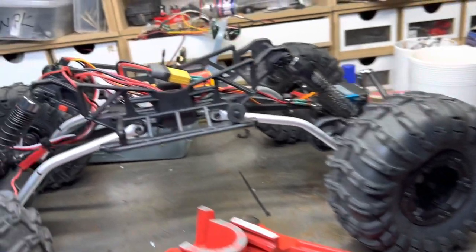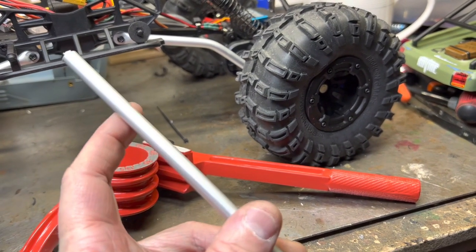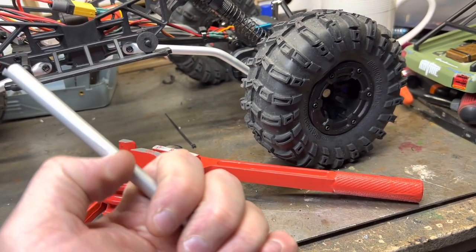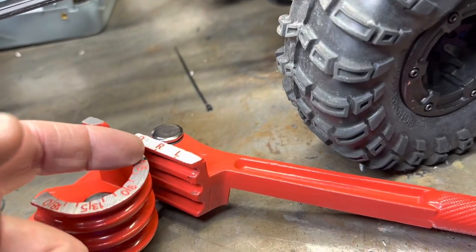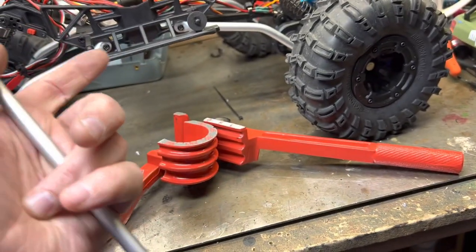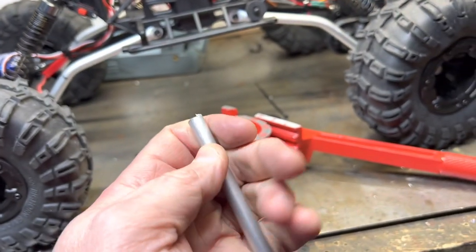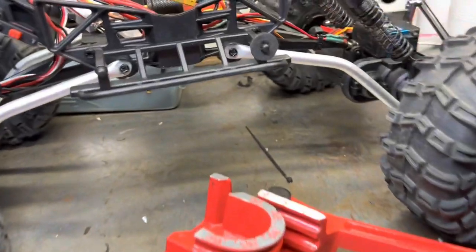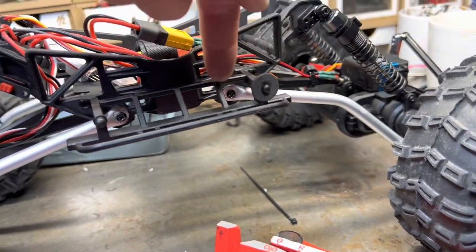The links are really basic — they're just tube. You measure the first one off where you think it might bend, put it in your pipe bender, put a mark where you're starting from, try to get to zero, then mark how far it's bending around to. Once you've done one and you're happy, you use that to measure against when bending the second one. Then I stuck it in my vice, crimped it, got a file, filed it around, and drilled the hole through. It's very crude. I also bent one end this way and the other end that way just to make it sit a bit better rather than being straight.